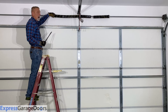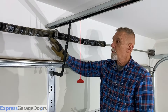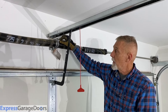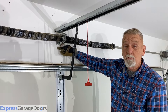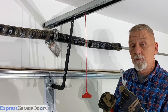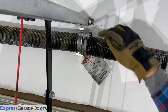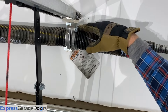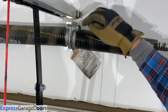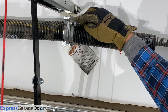The spring is totally unwound now. Once you've unwound your springs, you need to separate them from each other and the center wall bracket — a bracket that bolts to the wall. It takes two 9/16-inch wrenches. This bolt is jammed up against this spring wire because when this spring broke, it spun a little on the cone. You can still, by hand, undo this bolt.